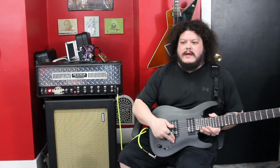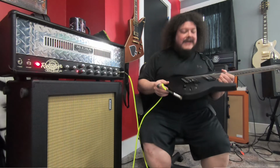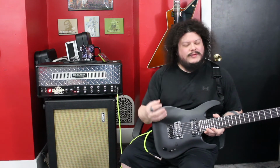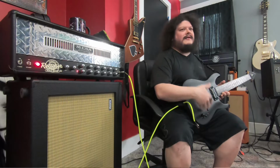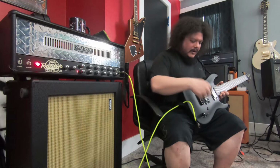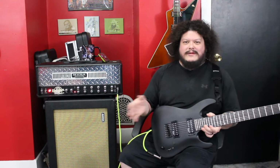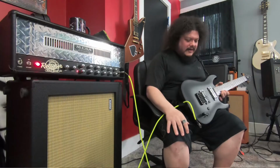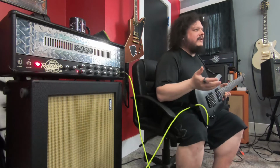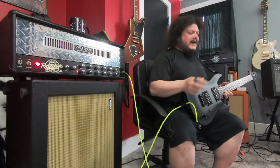Again, you're seeing there's a mount on here where I actually got the wrong size, stupid me, because I do everything on my phone. I reamed the hole too big and wasn't doing the proper sizing. I was just too excited to install the electronics with a new fresh CTS pot and make it one volume. I reamed it out too far, so I ended up getting some plugs on Amazon to plug into the hole, because I don't want a big hole showing on the body. It wouldn't look right, not smooth, just ugly. So this time around I did my research, did the proper sizing, and got the proper plugs for it, and for any additional future projects like that. But that's why this is so huge.